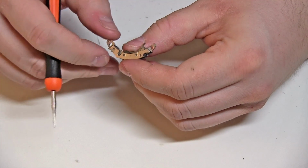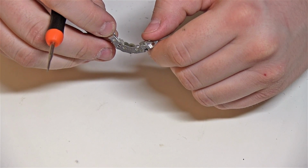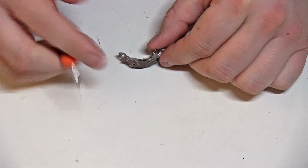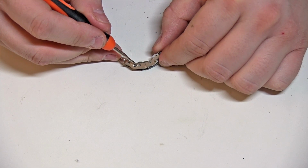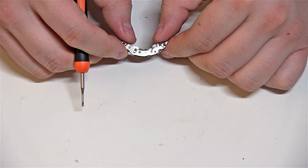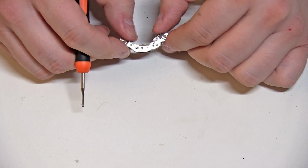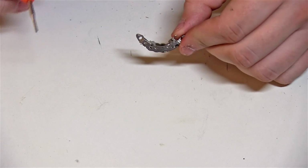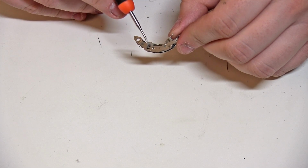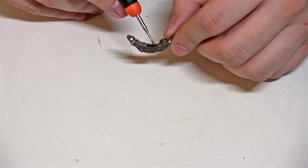This is the retard gear activator lever, or whatever I should call it. If you push that down, the retard gear will start jumping up, and that's how it works. The retard gear lever can be pushed all the way out, where it just pivots along its own axis there, which gives you the opportunity to fine-tune the tension of the spring itself by feeling around a bit.